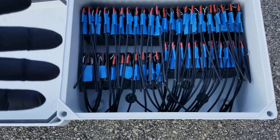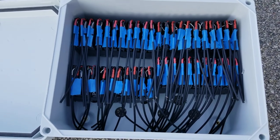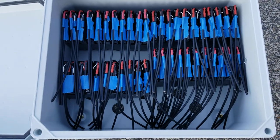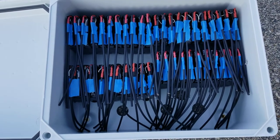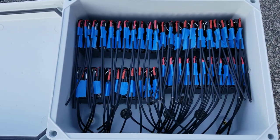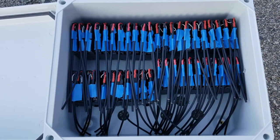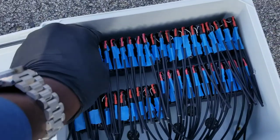The only thing that's not ideal about the 12 volt system is we're going to be under 11-point-something volts, which could be an issue for some inverters. I know I'm going to be hearing a beep like it's almost going to shut down with the yellow indication, but we can still run it all the way down to 10 volts. That means we have the leverage — instead of charging them all the way to the top and not discharging all the way to the bottom, so the battery is going to last a very long time.